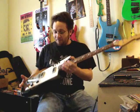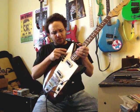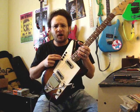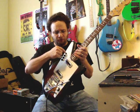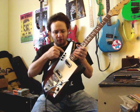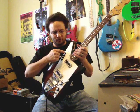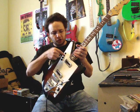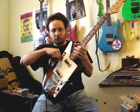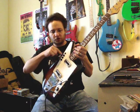It was interesting. I enjoyed it. The bank of switches are proprietary, meaning that it's all one long piece. It's not 4 individual switches. They're 4 individual push buttons, but it's one long bank of levers. The contacts are over here. So when you push down on a switch, it pushes a lever towards the contact. In this case, both contacts, and this one shuts them off.